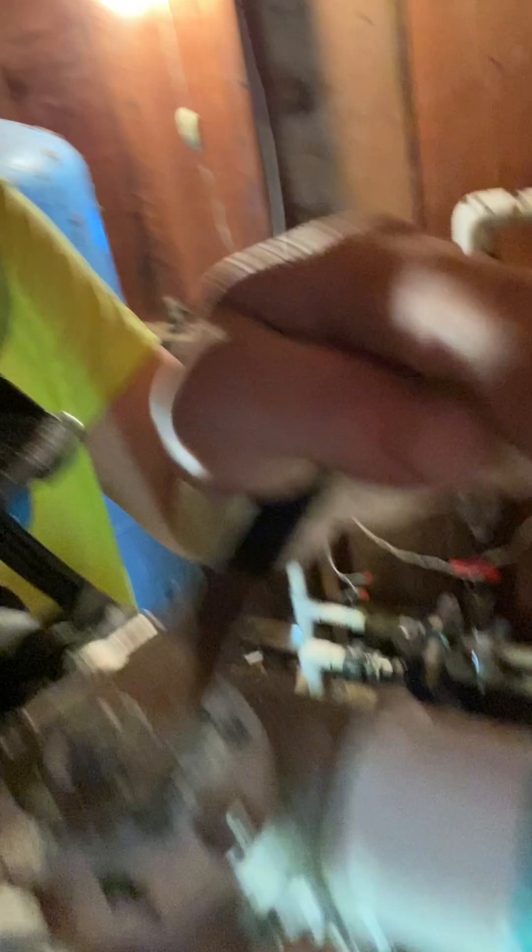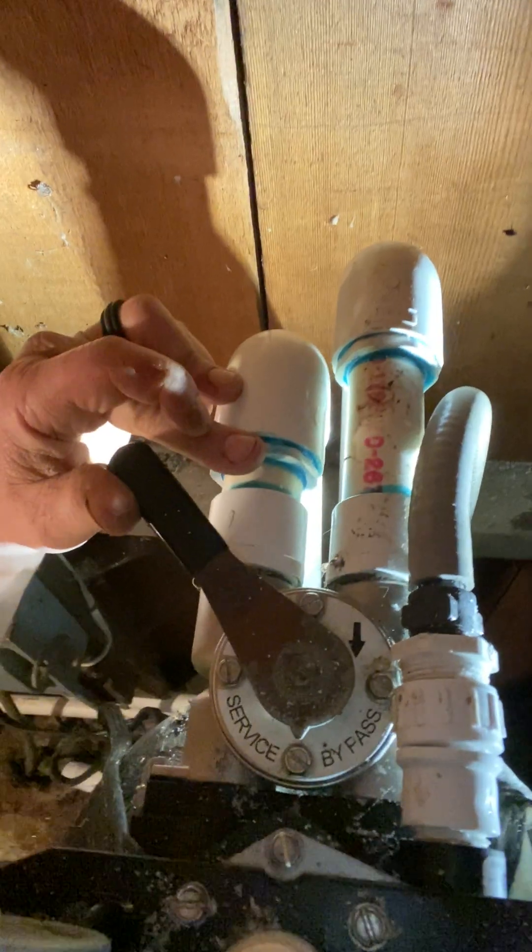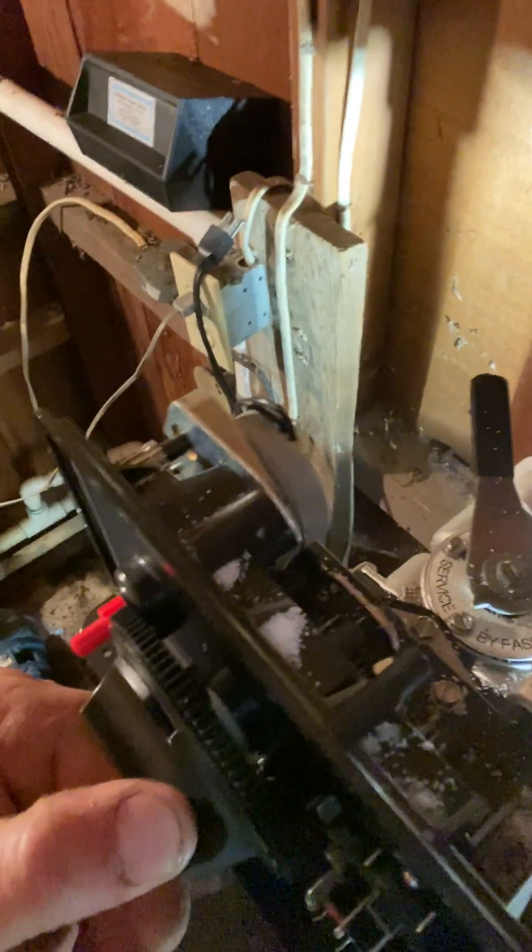So you've got this tightened up or your head tightened up. Take the bypass valve and crack it open — don't full bore it, it can clog the filter. Just barely move it. So if you're looking at it like that, it's barely moved — that's off, that's on. Then just wait for it to run clear — crystal clear. Run it in a bucket until it looks like water you're pulling from a faucet. It's going to be milky at first.